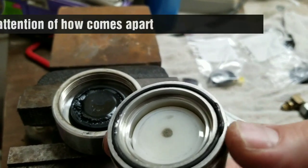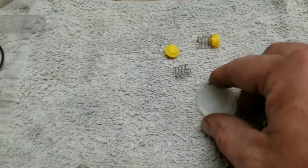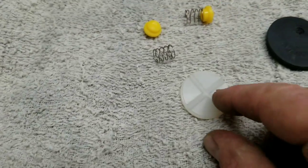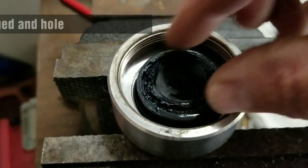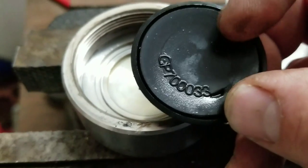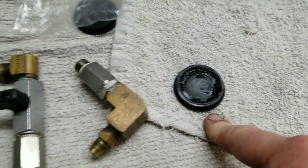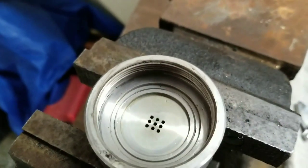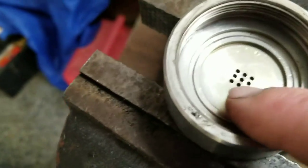Here it is. See that disc up in there - here was my problem. Notice how that disc has crosses on the other side - that means that goes down. This is where it's downward like that. See all of this eating here - that's from it hammering and then it gets a hole in it. See how this is in the dome and the cave. See that little hole right there in the corner by the numbers - that's where it's leaking and it's allowing chemical injection to go through all the time. I would wipe this out, blow it out with an air compressor, just clean it up. That seal from the top here is what's supposed to seal down in there.